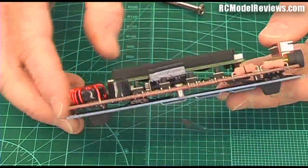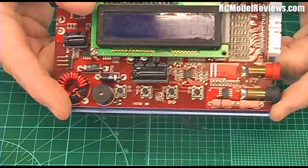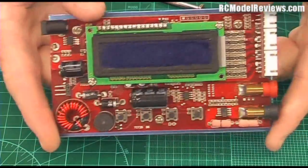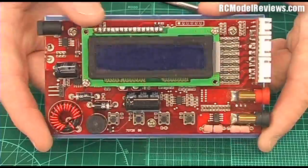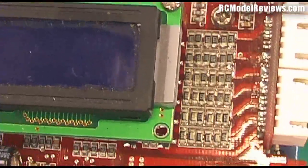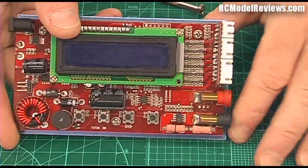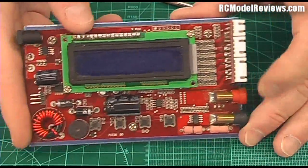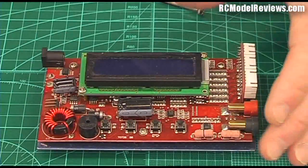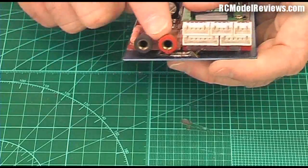Here's the LCD display sitting on a daughter board above the main circuit board. Underneath there is the microcontroller chip — the electronic brains that maintains the correct current and voltage for your battery pack. Over here there's a whole array of resistors. I'm pretty sure those are used during balancing, feeding off to the balance ports. This charger works differently from the Turnigy: it has one charger doing all cells, with charge current going out through the banana plugs until the battery is nearly full.